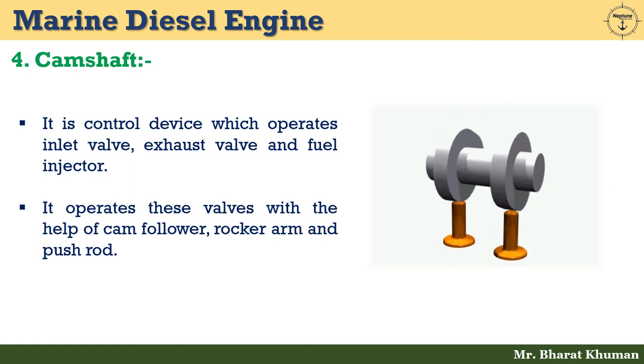It consists of a set of cams for each unit fitted onto the camshaft hydraulically. The whole shaft is supported by white metal lined bearings, with the set of cams made of steel. They have a separate lubrication system to avoid any contamination with the fuel due to leakage. A two-stroke marine diesel engine has fewer cams on the camshaft than a four-stroke engine, since there is no inlet valve in a two-stroke engine requiring cam movement for scavenging. To ensure correct timing for exhaust and fuel injection, the camshaft is driven by the crankshaft, connected by either chain or gear.